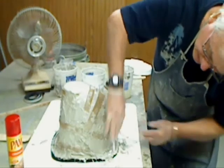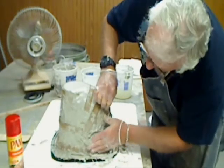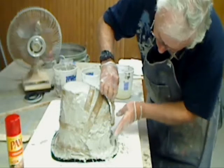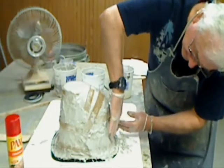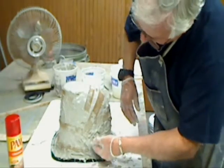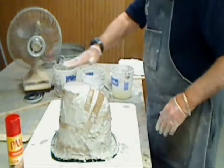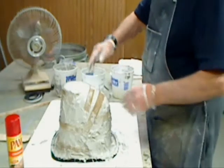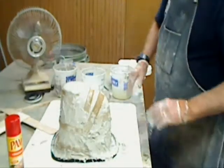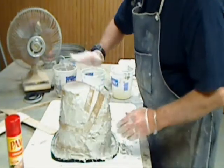I'm having a problem here in this bottom part — not quite enough material. It's gonna be thin, but it doesn't matter as long as you get a good second coat. As long as the first coat covers and sets up without any bubbles in it, then you can get the strength from the second coat because you slop on as much as you want. On this flat surface here I'll slop a bunch more, locate this little bridge, go across so I get a nice flat surface so when I'm laying up I can slip the mold over and have a good flat surface to sit on level.